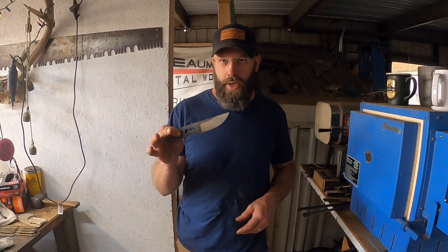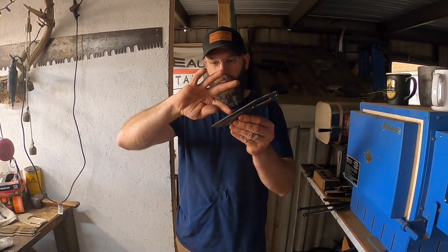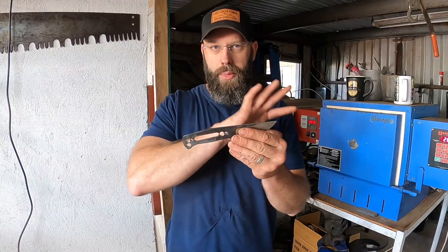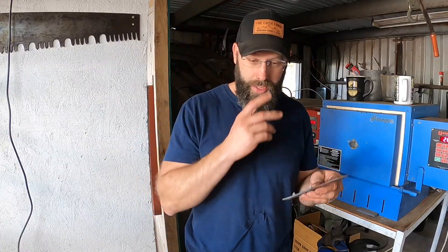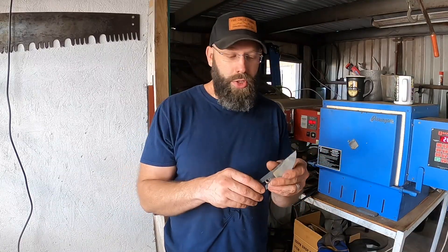Something similar is differential tempering — you heat and quench the entire blade, then come back and temper out the tang, handle, and spine so those areas are softer. The truth is most modern knife makers don't really have to worry about combining different types of steel, because with the alloys available today you can build a really good knife with the properties of toughness and edge retention within the same piece of steel using a homogeneous heat treat — probably 95% or more of every knife built today.